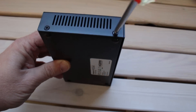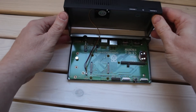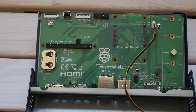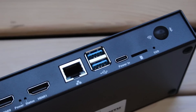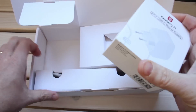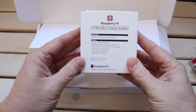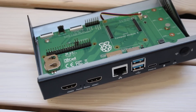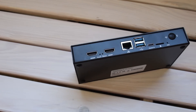The development kit comes with the 4GB version with 32GB of onboard storage. New things on the I/O board this time around include a power button, just like on the Raspberry Pi 5, a fan header, and USB-C power delivery — you can use the standard Pi 5 power supply. There are now two MIPI camera/display ports, down from three on the previous carrier board. And there's an M.2 slot for either storage or for connecting PCIe devices using the right expansion cable and adapter.